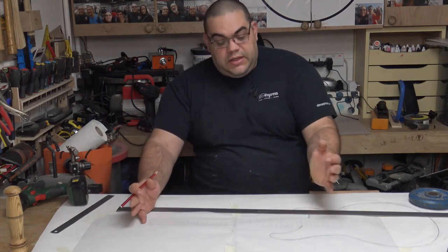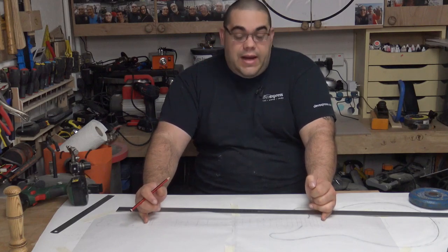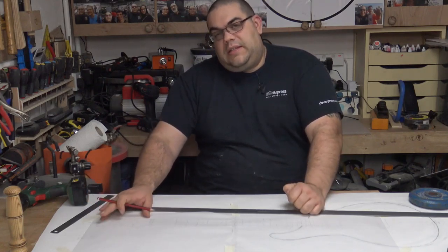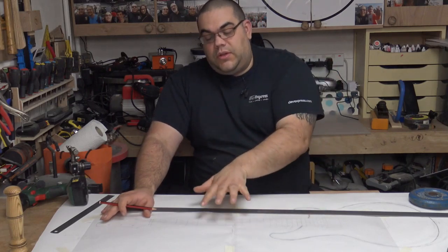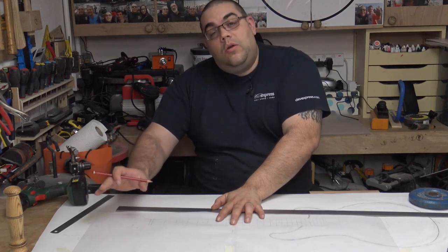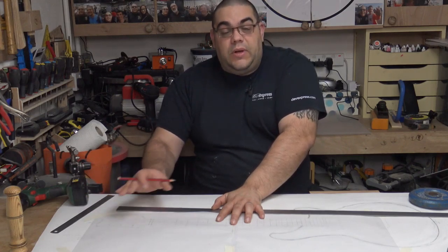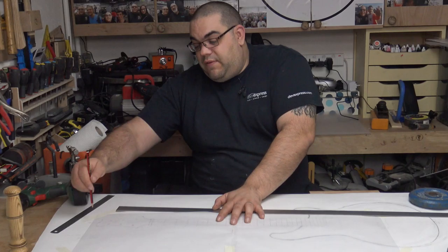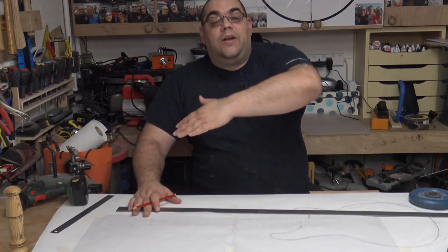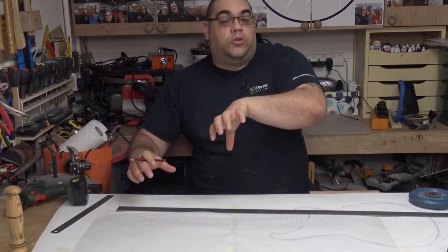Also, although this section is two-dimensionally correct, it will of course be at an angle to the rest of it. So we can't just trace around this and cut it out as it is, which is why I'm making a separate template for this. When it comes to cutting out the wood, I'll just leave this area fairly flat and fairly square, cut it at the angle, and then put the headstock template onto it